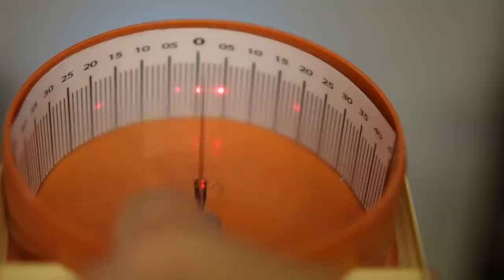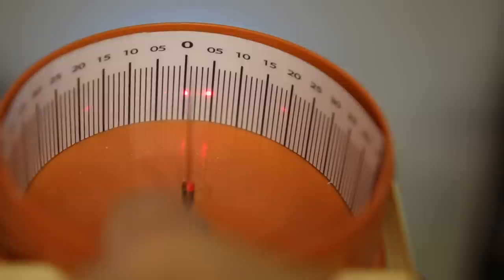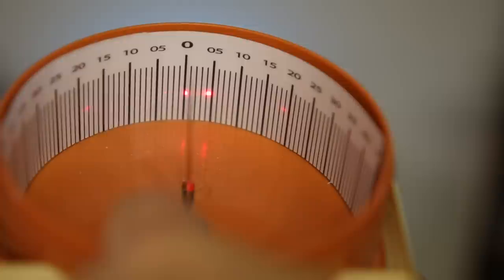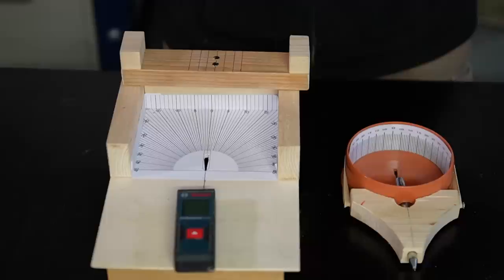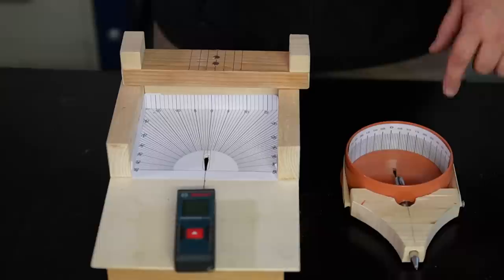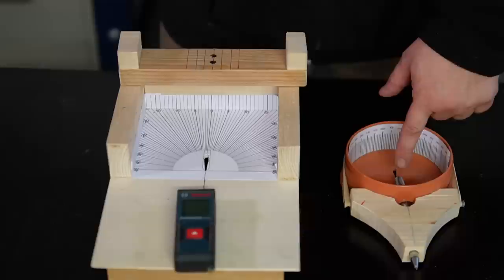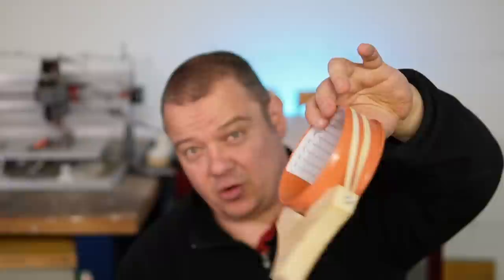As you can see, this laser goniometer also works perfectly: two times four degrees on the first bevel, two times nineteen degrees on the second bevel. The advantage of this sewer pipe goniometer over the paper goniometer is that it's smaller, and you can adjust the scale if the laser ray doesn't hit exactly the zero point. The reflected ray also hits at a 90-degree angle to the surface, which makes the reflected point sharper. The disadvantage is you need a bit of talent in manual work.